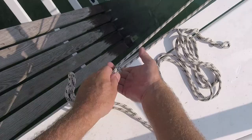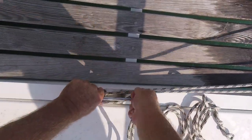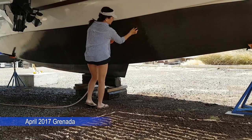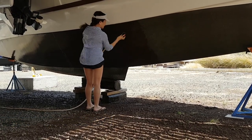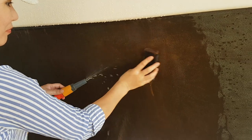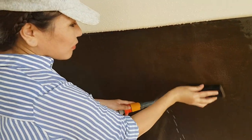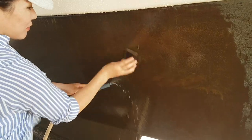So after six years, how much longer do we think our Coppercoat will last before we need to re-coat? And if it's a hard coating that doesn't ablate or wear away, why would we need to re-coat it at all? Each year we slip Luckyfish out of the water and do our maintenance, but before she goes back in, Coppercoat advise you to hand sand the hulls with 600-grit wet and dry. This is to expose fresh metallic copper. We have found the sanding can be sped up by using 400-grit, but of course sanding down does thin the thickness of your remaining coating and limits the lifetime of the product.